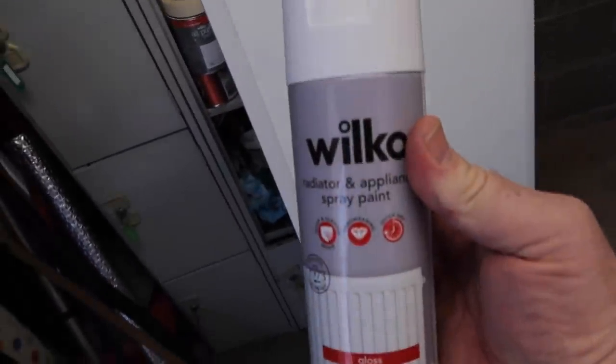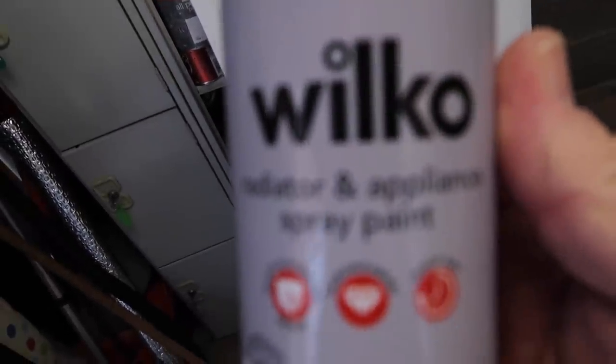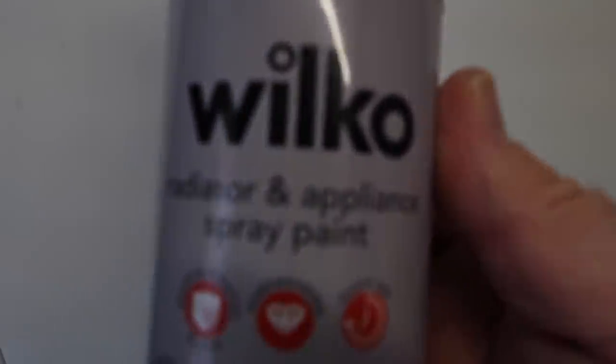This is the said piece of plywood that I was on about. I've sprayed it with radiator paint because I wanted it to have some kind of shiny look and be a bit more hard wearing. A conservatory is going to be hot, it's going to be cold - temperature extremes. So I've primed it and then spread it with radiator paint. What we've done here is use the trimming cladding with a U section going round the edge to finish the wood off - so the cladding slides into that groove.